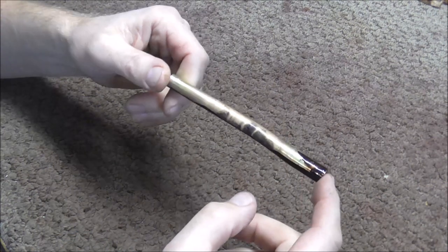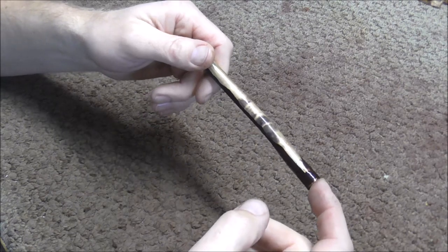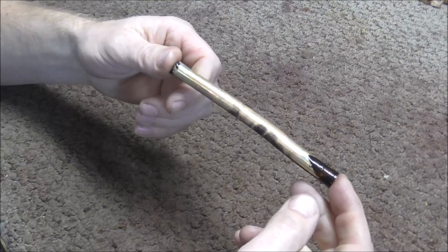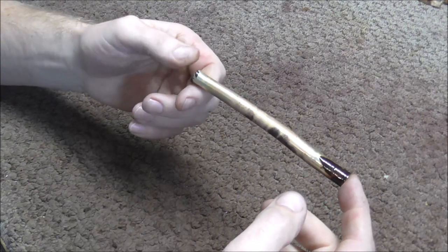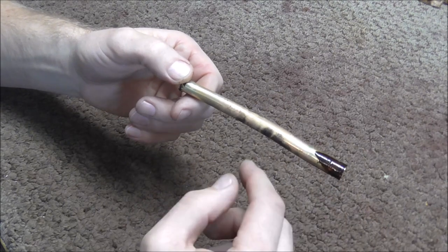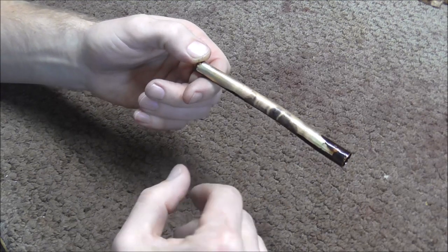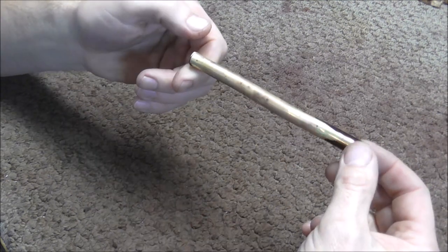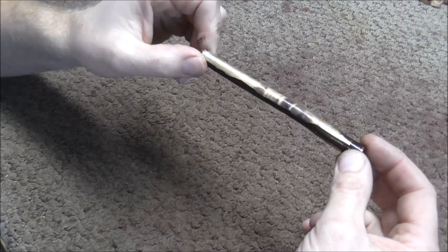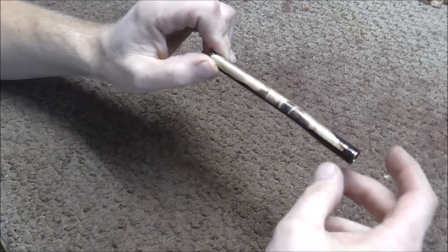The tube has cooled off and it's ready to bend. You want the tube to be room temperature or cooler when you bend it. Sometimes if you're handling it a lot, your hands warm it up, and if that happens you want to let it cool off again before you continue. When bending French horn lead pipes you often need to let it cool off. You may see that the tubing is already slightly bent due to some damage to the instrument, but I'm going to be bending it anyway so I'm not really worried about that.